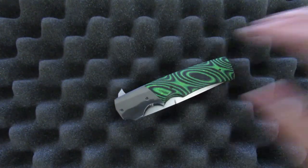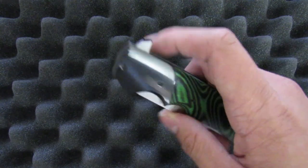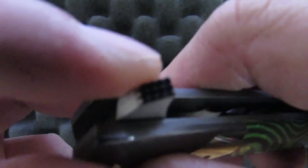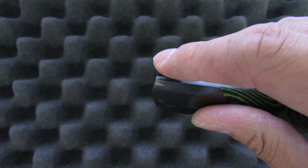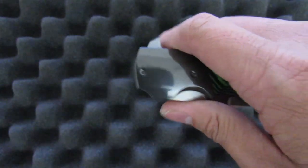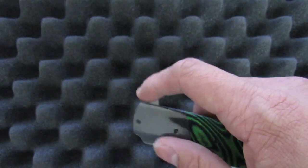One thing to mention as a side note: especially on older knives, the flipper will sometimes not be all that well chamfered. And since he checkers it, that checkering extends all the way to the edges. So when it's not well chamfered, you end up with basically small metal spikes on the edge of your flipper — like a bed of needles effect when you flip it head on. If you brush against the side of some of the older ones, it'll scratch you and the inside of your pockets too. It's not the case on this one, but I'm just putting that info out there.